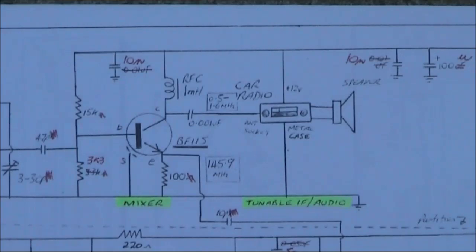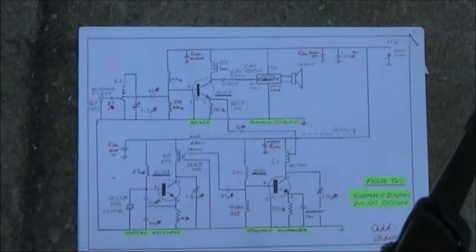That's got to have a shielded connection, otherwise you'll pick up breakthrough from local AM broadcast stations. There's nothing new about this arrangement — it was used about 50 years ago when people were getting onto VHF mobile AM. It largely fell into disuse when FM and repeaters came along. But as you heard before, the reception of FM signals was still acceptable.